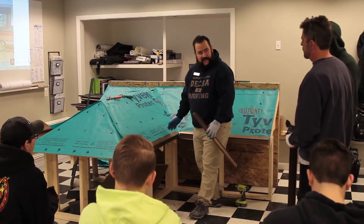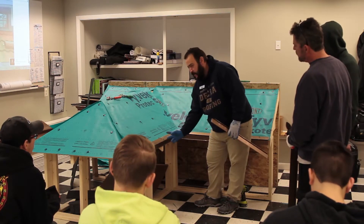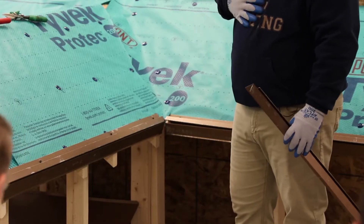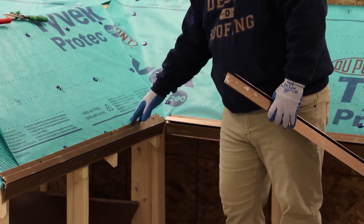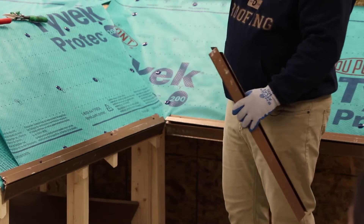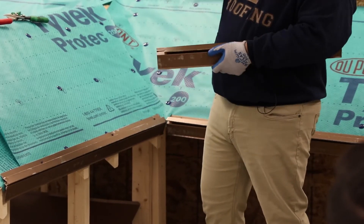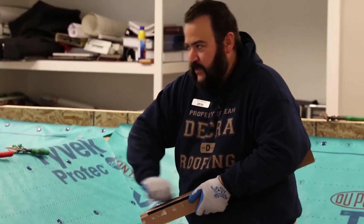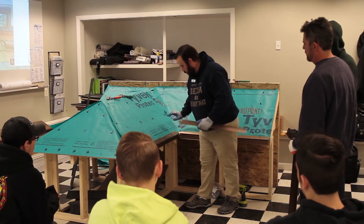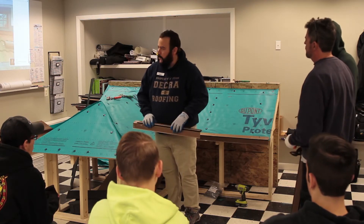I like to get my inside set like this. I'll drop a little piece of valley metal in, make a quick mark, snip it, score it, and just snap it right off. I like having it installed — that way the roof's holding it in place when I'm running the utility knife on it, not holding it in my hand. Because if you have tension and it slips, you lose your balance on the ladder. So I like to have it in place, score it, and peel it off. For me it's safer. Everybody learns their own techniques of what works, but that works for me.